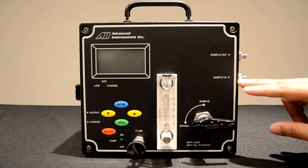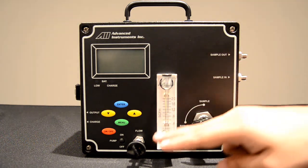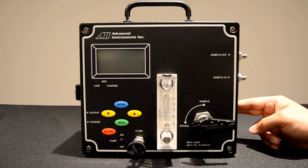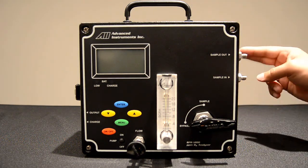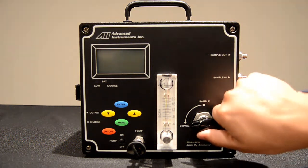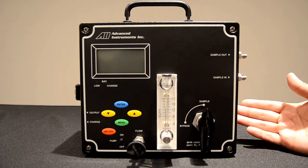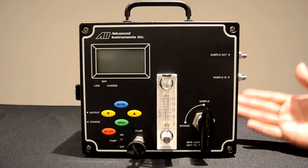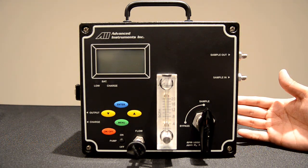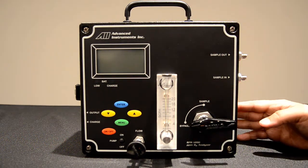You'll connect at the sample inlet and flow your gas through the analyzer. You'll adjust the flow rate with the flow valve, and we recommend a flow rate of 1.5 SCFH. Once flow has been established to the analyzer and has been purged out for a few minutes, you will switch from bypass to sample. The sensor will respond accordingly as the flow goes across the sensor head, and your reading will be shown. Once the reading is recorded and noted, you will switch the analyzer back to bypass mode.